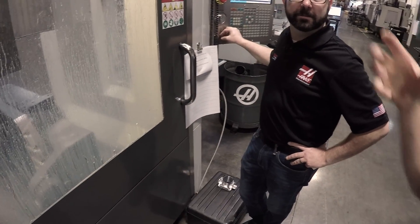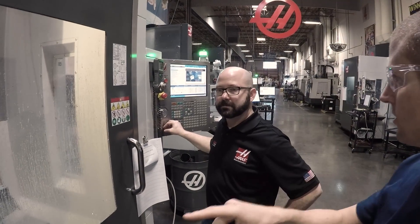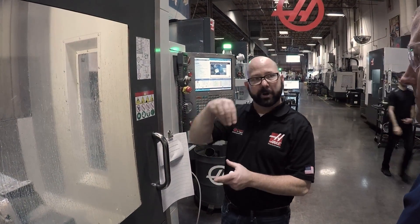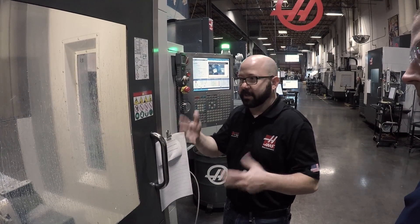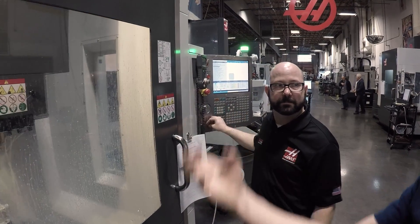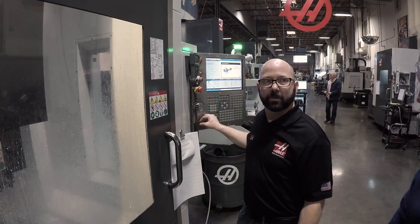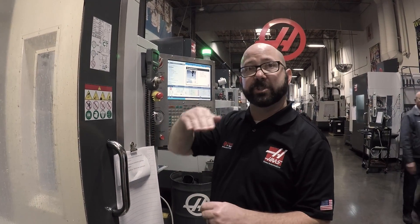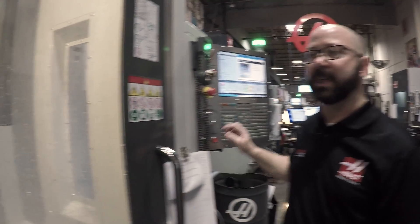That did a quicker tool change than mine after TSC. Mine has to wait for it to purge. It might be the tool we're calling up. A lot of times we let it go ahead and purge around the CAT-50 taper because it's already tilted — it'll run fine. There are a lot of things you can do to speed up tool changes: don't call up an M5, don't stop the spindle first, don't call up an M89, and definitely don't turn TSC off before the tool change. Just finish your operation, call up the next tool, and the machine takes care of everything faster.